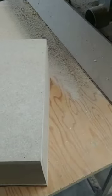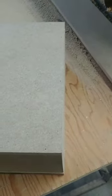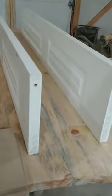We're going to cut some pieces to put together our bookshelf. All right, so what we did was we cut ourselves some long strips on our table saw here. We got some MDF, some stuff we had left over from our last job. We cut ourselves some long pieces, roughly 4 inches wide. And then we sat our doors up here in the position that we want to have them when we put this together. Cut these down to smaller pieces with some squares for the top and the bottom. And we built ourselves a small box, 4-sided with a bottom.